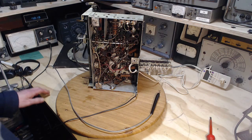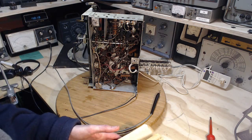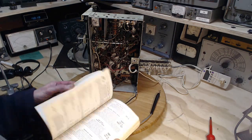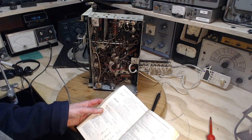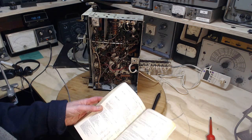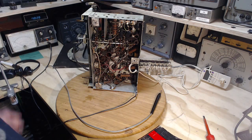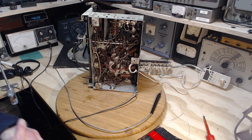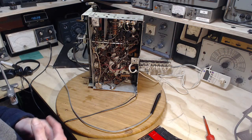Getting his morning exercise. Now, I should probably take a moment and determine which pin it is, although I'll test all the pins on the tube. 6K6. Yeah, don't look at everything on the internet. See how fast that was? 6K6. So there we are. We're all set. It's got three grids in it because it's a powerful tube, blasting electrons at the plate. In order to suppress the bounce back and also to affect the inter-electrode capacitance, it has these extra grids inside it.